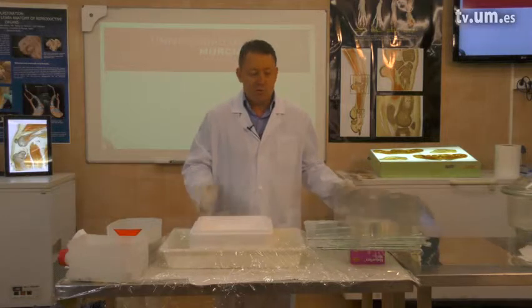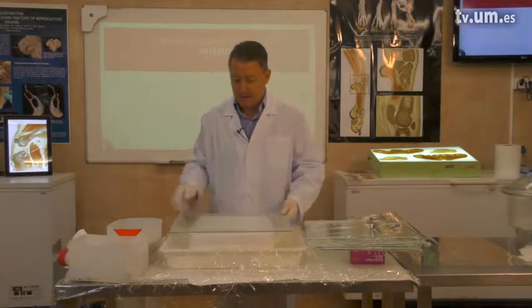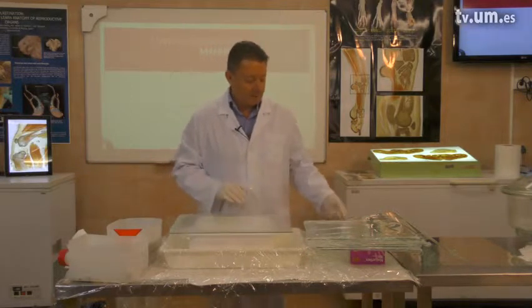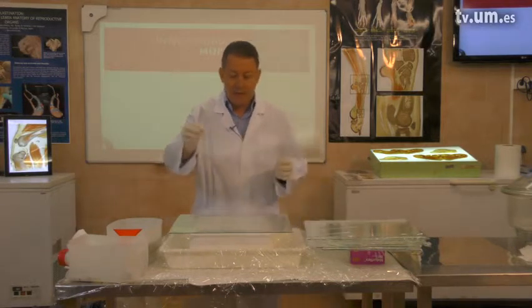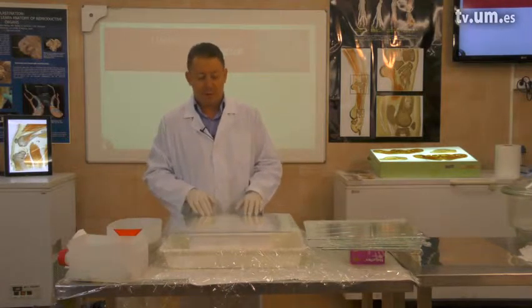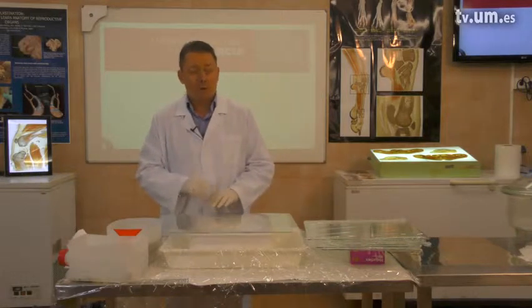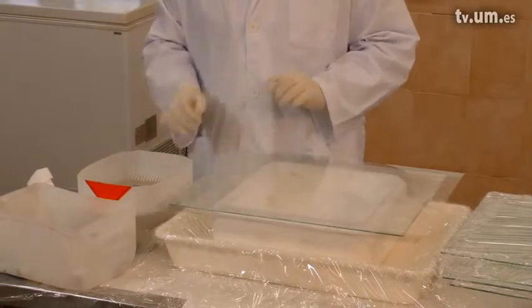The first thing to do is place a glass plate in the middle of a styrofoam block. On the glass plate you will place a thin 0.25 mm foil — a polyester, polystyrene foil — and then actually the casting can start.